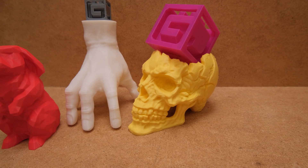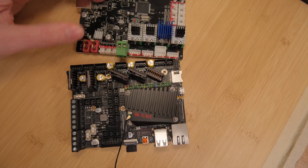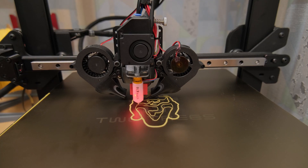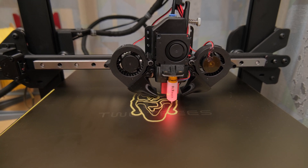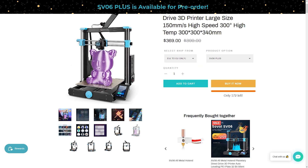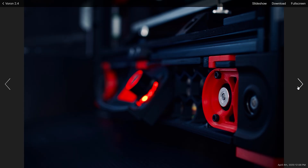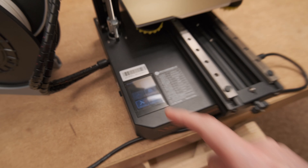So, with many tests done, my suggestion if you want to chase that perfect print quality is to start with Klipper — either by upgrading the whole board if your current one is lacking, or using anything that can run Klipper. It is not a beginner-friendly way, but all the trouble can be worth it in the end. And if you have a printer with V-wheels on all axes, are these mechanical upgrades worth it? As much as I love designing, upgrading, and testing things, at least cost-wise it makes very little sense — especially when you can buy a linear rod printer for a low price and Klipperize it for not that much. Sure, it has weak print cooling, but that's only one small thing to worry about. But if you want something with no compromises, you have to make upgrades yourself or build something designed without profits in mind, like a Voron. Because I highly doubt you will ever get a no-compromise printer from any profit-driven company — there will always be a catch.